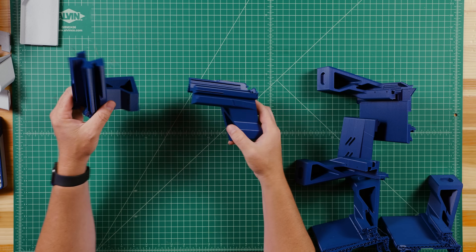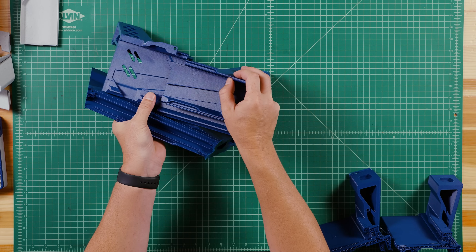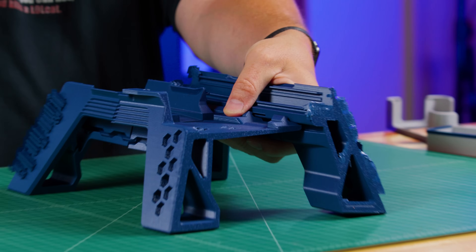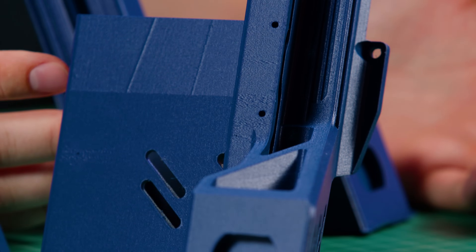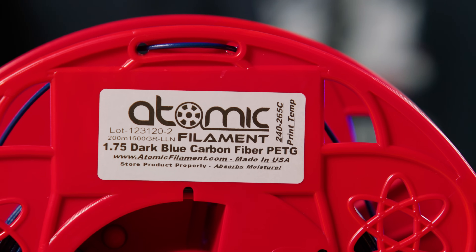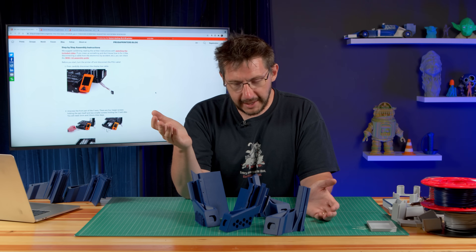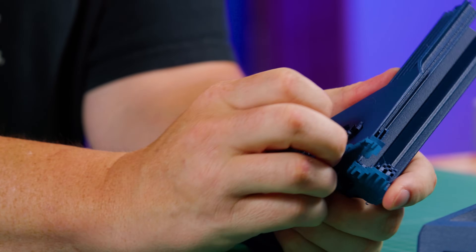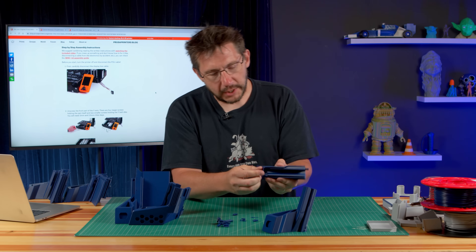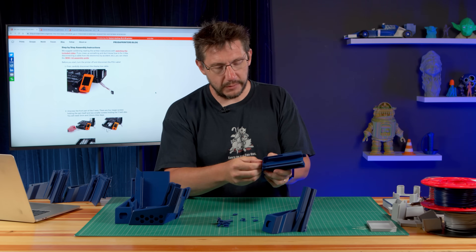These are the actual legs that go together, and the Mini is going to sit right on top of that. There are supports that were generated by PrusaSlicer, and I think the prints did well. This is Atomic's carbon fiber PETG. In PrusaSlicer I used Prusament PETG defaults and it came out great. I don't do a lot of PETG printing, so I wasn't sure how supports would work, but they come out great. I've got to get the support off all of this, and then we'll start the process according to the assembly manual.